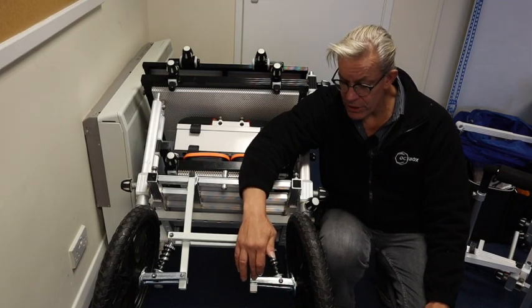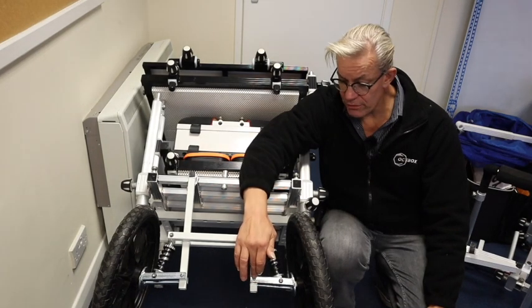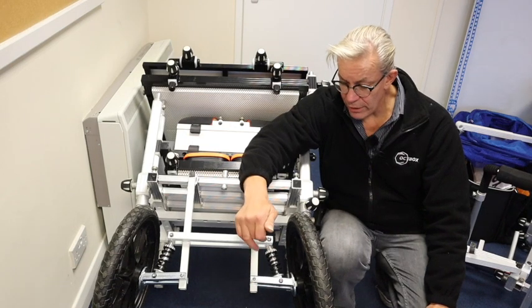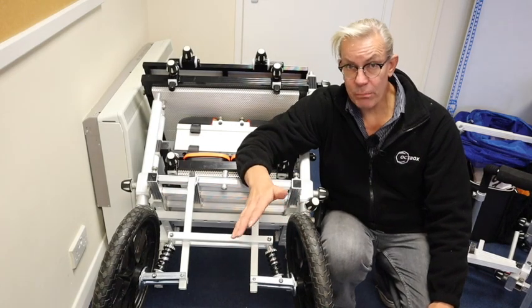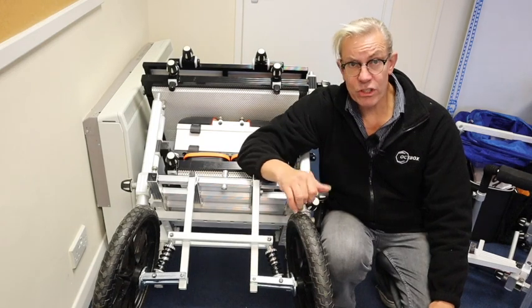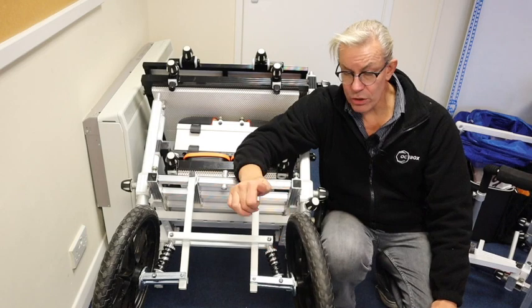And because this bolt is M6, you'll be measuring, if you took the bottom part of the hole and measuring 17 millimeters, drilling the hole, that'll give you two holes. So I'll get that machined now. I'll video how I'm machining it, how I'm fitting it and doing it, and then we'll see the difference when I refit it with the longer shock absorbers.